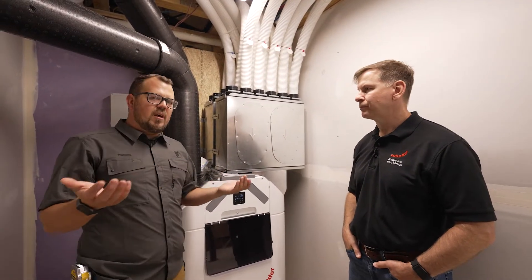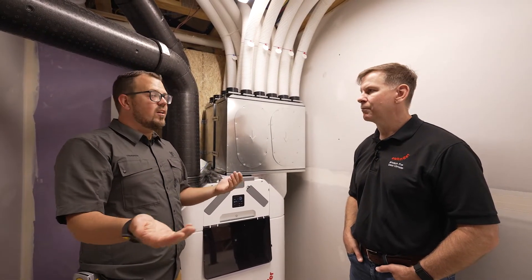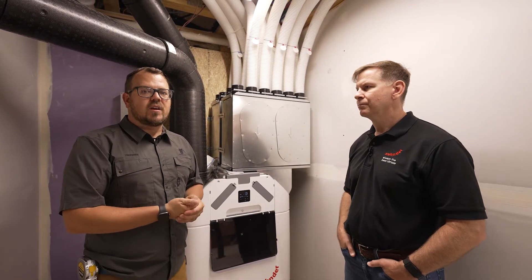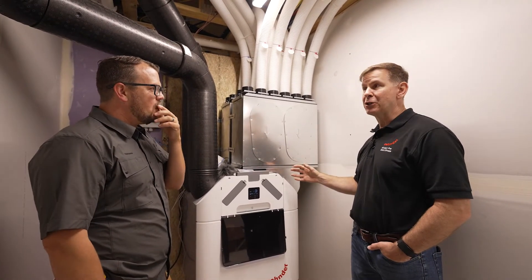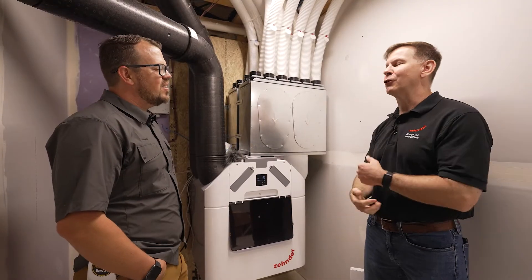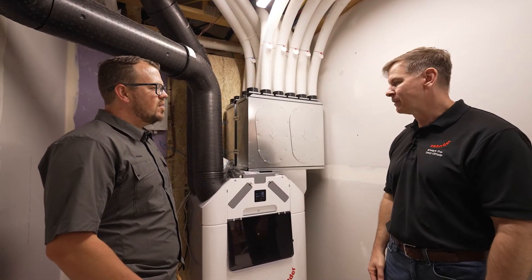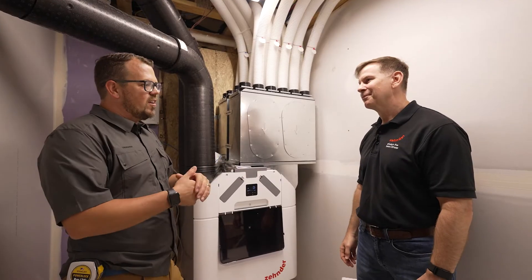Short term that's not a huge deal, but if you have a lot of consecutive cold days where you're snowed in and not opening doors or windows, it could become musty inside because you're not bringing in new air. The way it gets made up for is you oversize the unit and run it at a higher ventilation rate during the times it is running to still meet the ASHRAE standard — but you end up spending more money on fan energy. Adding the preheater is the way we prefer to do it.